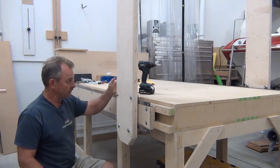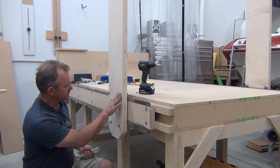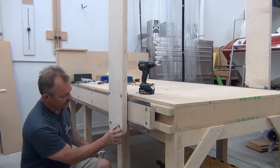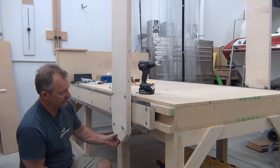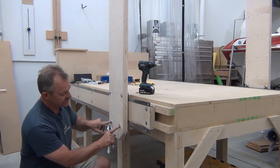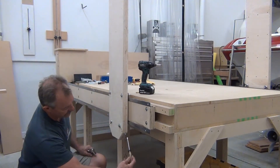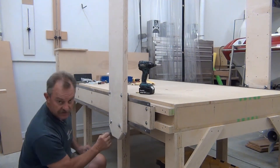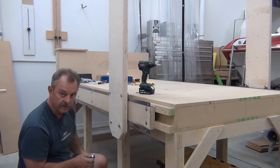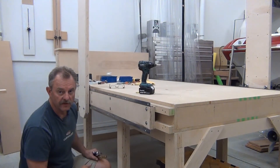This one rolls great and the one on the other side rolls pretty decent as well. What I did is tighten these completely and tighten these just until they were about snug, where they could still slide a little bit. When I ran this all the way down the rail, it pushed these out just where they needed to be. Then I used the Phillips head screw and tightened it until it just touched the bolt to hold it in place, then snugged it up all the way. These things roll all the way down without much of a problem.